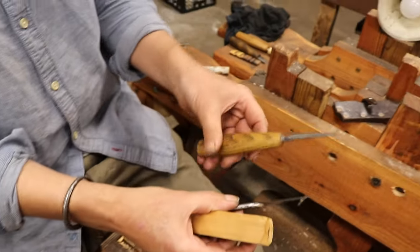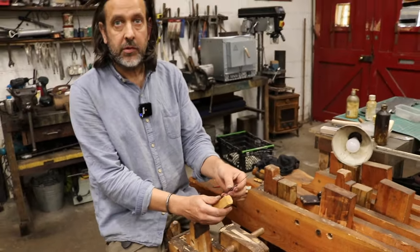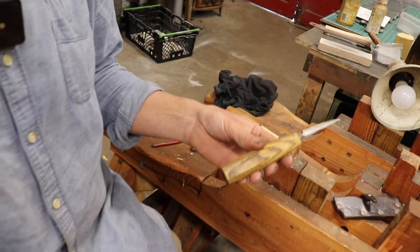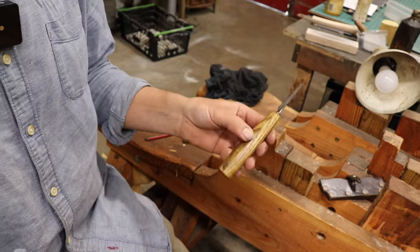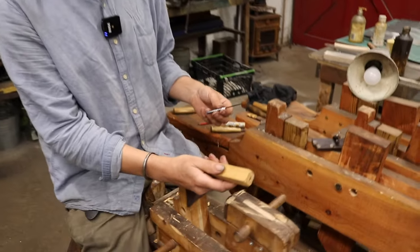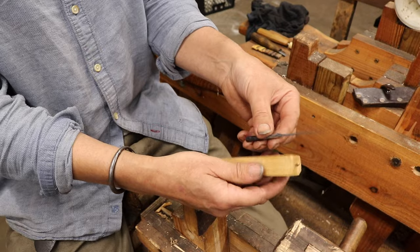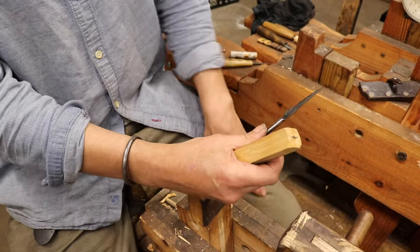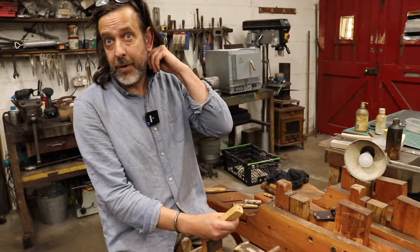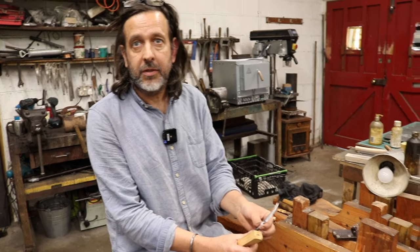One quick question before you begin — wood selection for handles, do you have a preference? Yes — ash is my preference, but I haven't got any to hand at the moment. So I've got some alder, which is nice and soft, quicker and easier to shape, and a little bit lighter. Ash works really well, and if I had all the money and time in the world, boxwood would be my preference, but it's not really economically viable.